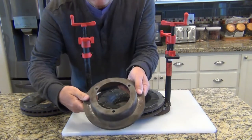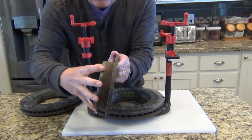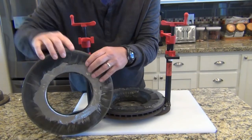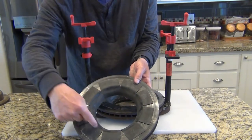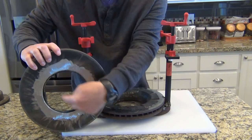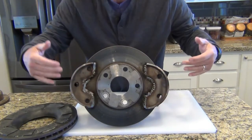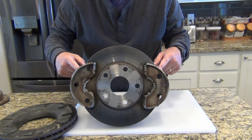Here's a smaller brake rotor off an airplane just to demonstrate. I took the brake rotor and cut with an angle grinder all around and cut the top part off, so the drill bit can go through that hole — if you didn't cut it out of the way, it would be in the way. I also used an inner tube, some spray adhesive, and made a rubber gasket so the ball won't get scratched and will grip tightly. I took the piece I cut off, sliced it in half with an angle grinder, and welded it onto the bottom part of the rotor, leaving the attachment point to weld the pipes — otherwise the ball is wider than the rotor and it wouldn't have worked.